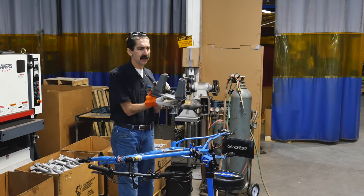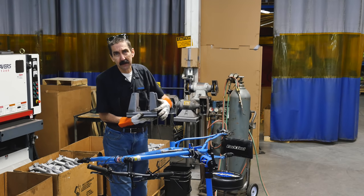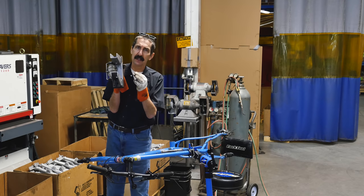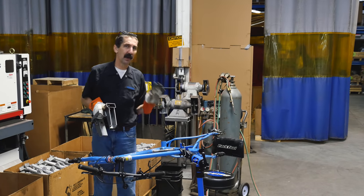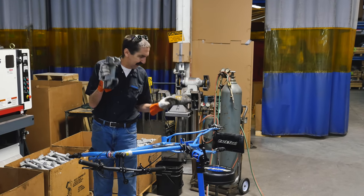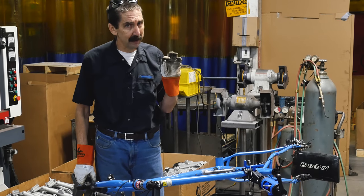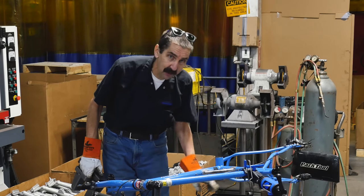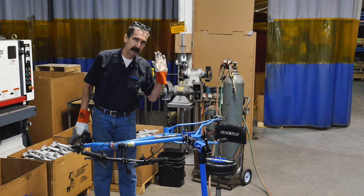So this is a sample of some welding that's done here in the welding department. This is a wire feed weld. It's thicker material. Here we're actually melting the base material. We're trying not to do that here. Brazing is a different process. However, a little bit of wire feed was used by Truman. You can see this little spot weld down below. Just a little tack dialed down just to hold it in place.